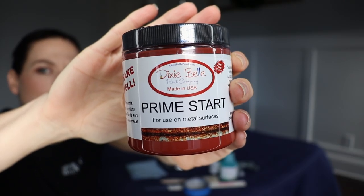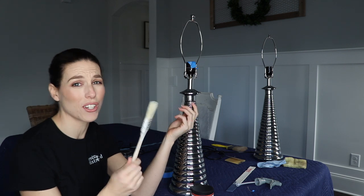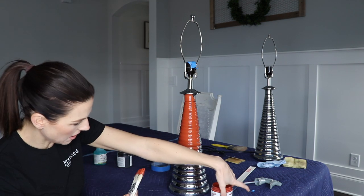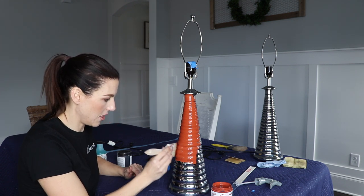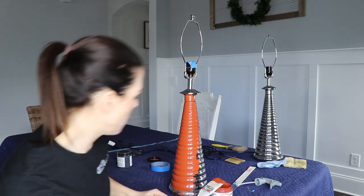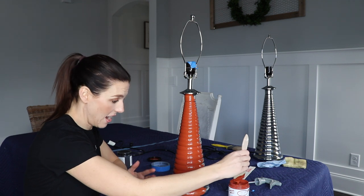So this is water-based, and I'm just using a paintbrush I have. I used to use chalk paint sometimes, but it's not one of my favorite brushes. I should be able to clean everything up with soap and water, so you can use any type of brush you want. So I'm shaking this up and just going to dip it in and start painting it on. It says no VOCs, but it's got a pretty strong odor — a lot stronger than chalk paint — so I'm going to pause and open my windows. If you want to use a mask, do that. The more protection you have, the better off you are. You can wear gloves and all that.